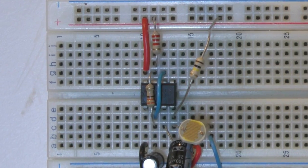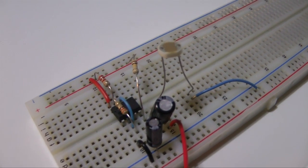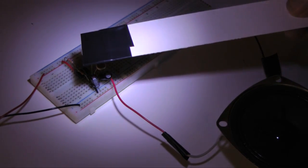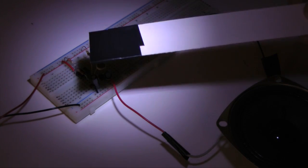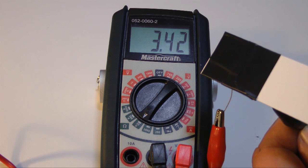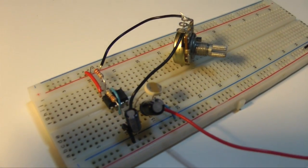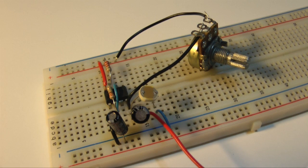This resistor has the color bands brown, black, yellow. The circuit is ready to test. Shine light on the LDR and the circuit is quiet; block the light and the tone sounds. You may have to experiment with the value of the added resistor R3 — 100,000 ohms worked for mine, but the resistance range of the LDR determines the value of R3, and this varies significantly depending on LDR design. Another approach is to replace R3 with a 200,000 ohm variable resistor and adjust until the circuit works as expected.